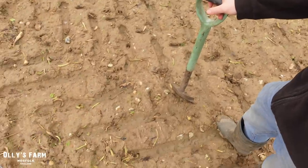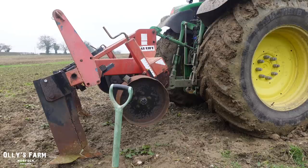So we're just out in the field now. I'm just going to try and work out if there's any compaction along this side, or how deep it goes with a spade, and then we'll get my tape measure and work out how deep it goes in there. On the back of the subsoiler there's the depth wheel - we can just change the depth a little bit, and then afterwards I'll just measure it with a bar and a tape measure to see how deep I'm going to make sure I'm doing a good job. Just dug down with my spade, measured it with a tape measure, and we've set the subsoiler at 13 inches, which is 2 inches compensation. So we'll see how we get on and just try a few rows.